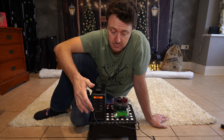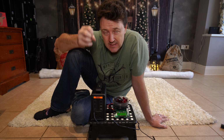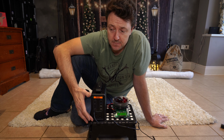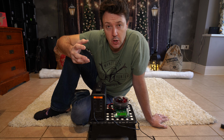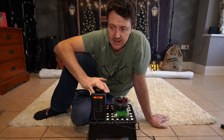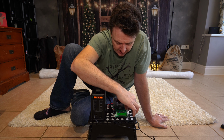So for example, on the 12 volt, you can draw 12 volts, 10 amps continuously, and over that, the BMS shuts down the battery. And with the plug socket, it's 240 volts, 150 watts. So over that, it shuts down the battery, and then 2.4 amps on the USBs and 18 watts. So let's just try that.